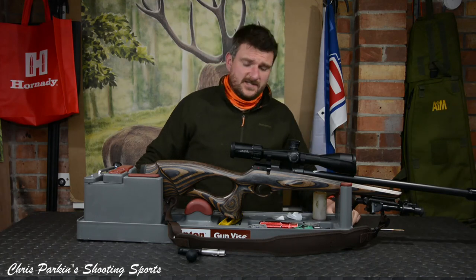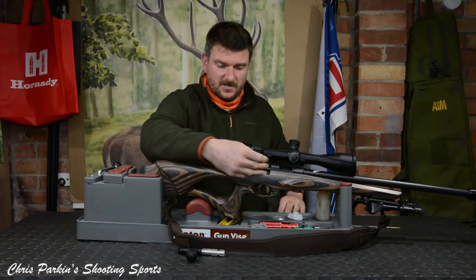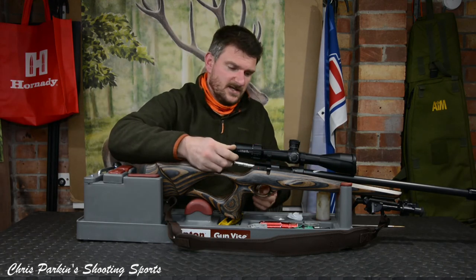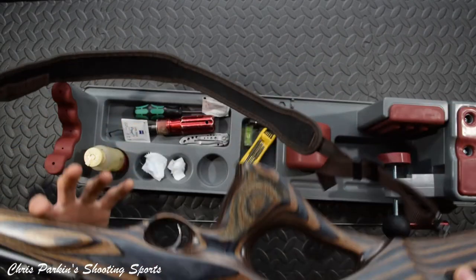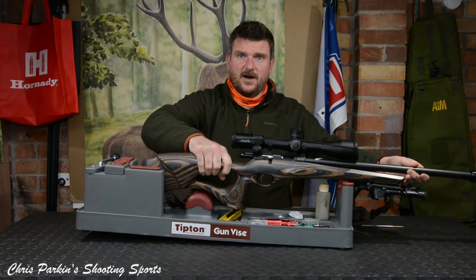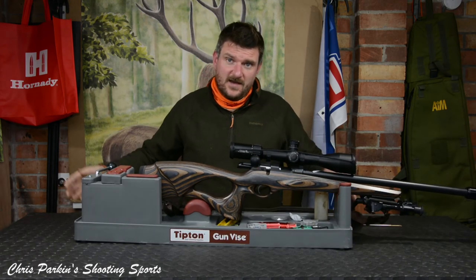For those who watch my channel on a regular basis, you'll probably recognise the standard Tipton gun vise which sits on the wall behind me here. This is my daily tool kit, because I've got my allen keys in here, I've got cleaning solvent, cleaning patches, and when I'm cleaning rifles I can use the cleaning rod and I've got full access to the rear of the gun in a straight line to clean them through with no intermittent problems. I can see everywhere, I can move around them, and when it comes to scope mounting, bolts in and out, I've got a completely secure hold. This one has a clamp on the back with adjustable jaws on it, and a V-groove at the front. So the rifle will just fit in there, slot down at the back, and I can nip that up to compensate for the width of the stock and then just lock the handle in place. And if I lift that up now, the front will come up because it's only in a V-groove, but the rear is solid and stationary and it's not going to slip or push out of the rest. And the rest underneath, like all the other Tipton rests, has got rubber feet so it stays fixed in position.